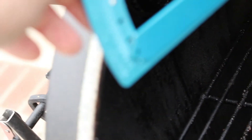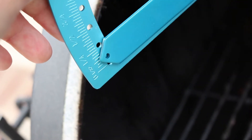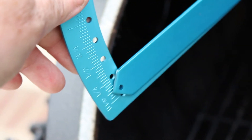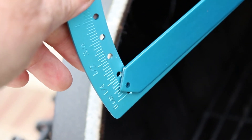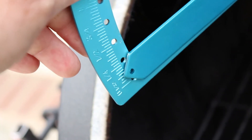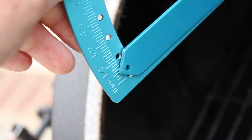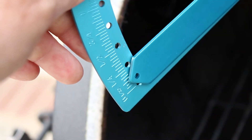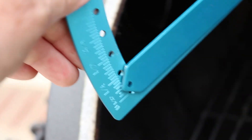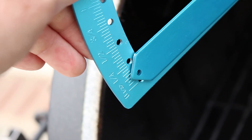I want you to be able to see what you're going to be drilling through. Measuring the thickness of the metal here — it is an eighth of an inch thick. So you're going to be drilling through eighth-inch metal on here. I don't know what the gauge is — I'm not a metal person — but it's substantial enough for this cooker, and drilling through it taking your time with a step bit is really the best way to get through it unless you have some other easier way to make that inch and a quarter hole.